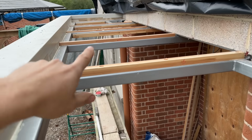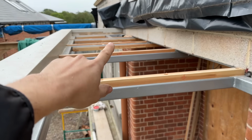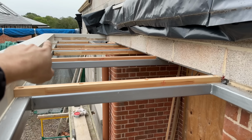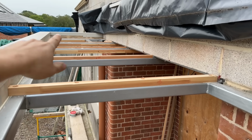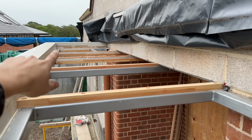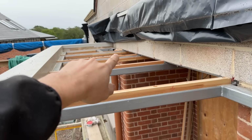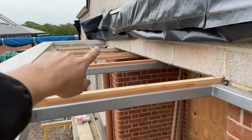But I've got these tapered battens down to where the gutter outlet is going to be, and it all flows across the roof flat, so it's higher this end than that, but on a level. And at that end we've got a tapered one back to the gutter outlet, so it should be the lowest point over there in that corner.